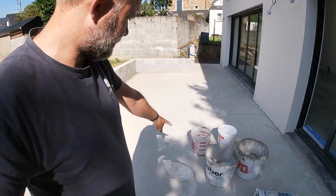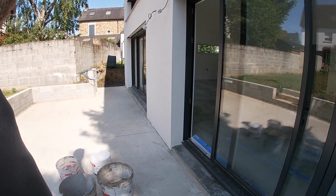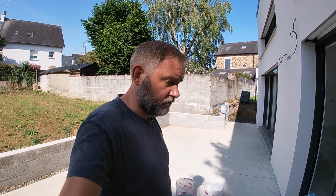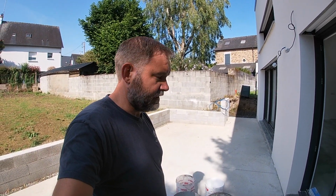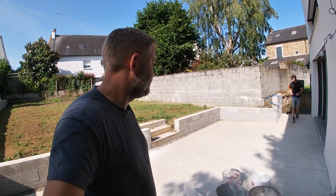So measured out 6.5. Sure that says there. That's the bucket to mix in. That's it. Always mix one bag. Don't try and do a half bag unless you know what you're doing. Just do a full bag and use it up. It's quicker and easier because you can just mix the two together, mix it, and it's done. It's really that quick. And you can get on with tiling, so the time is spent tiling rather than faffing around with adding water and adding powder. A mix? Yeah.